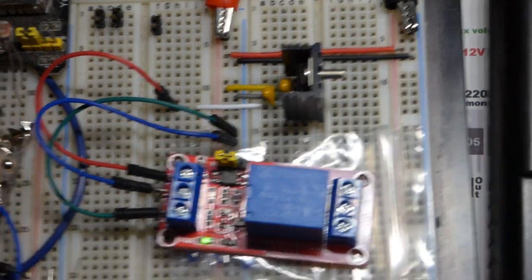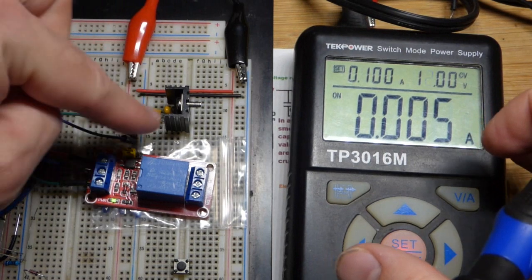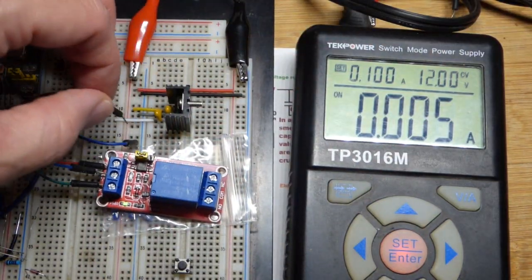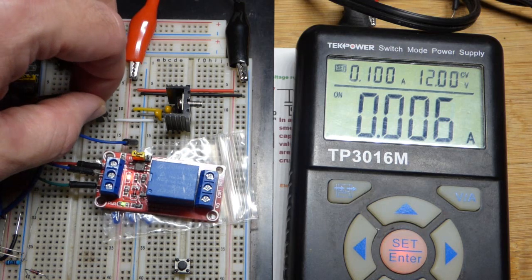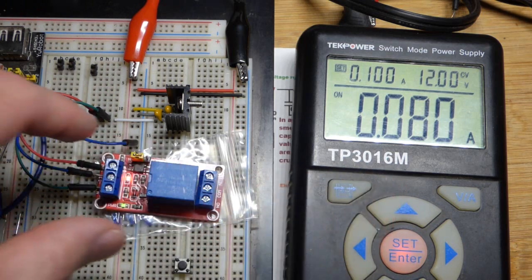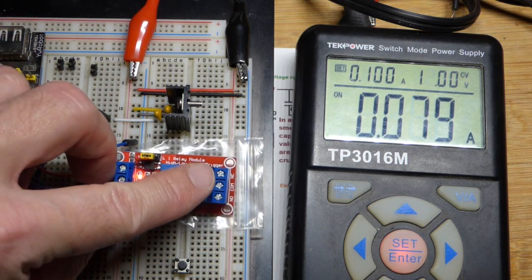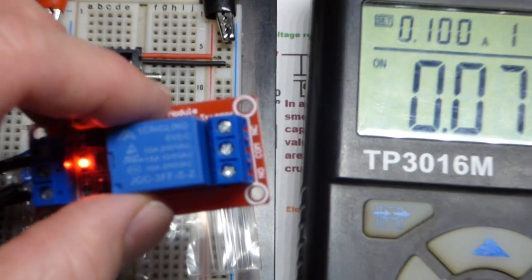The power is on. We've got 12 volts there powering the rail, and we have our regulator. You can see the green LED lit. I think it's actually safe to switch with 12 volts, but I'm not sure — I didn't fry it, so that's a good sign. We plugged it in and you can see the current's a little bit lower. Now we've got it switched — you can see the red LED on. It switched from the normally closed position to the normally open position.